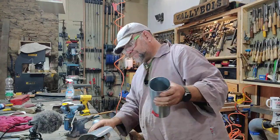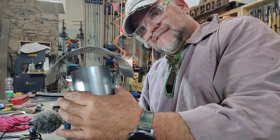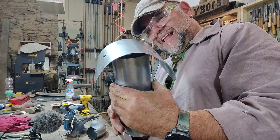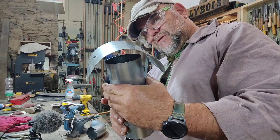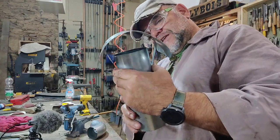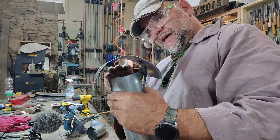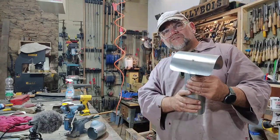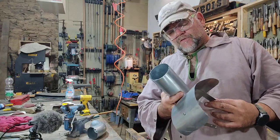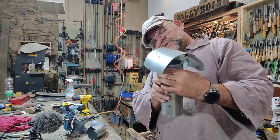So here's my pipe. That cap needs to be attached on there, like that. Now you don't want to be too close, for obvious reasons — you need free flow of gas. The area on top needs to be enough so that whatever comes up that tube can escape. That's plenty enough. It's also going to stop the rain getting in, but also allow the wind to blow over the top to help the draw — you know how chimneys work. You blow over the top and it creates suction through the tube and gets the gases out. With a pellet burner there's its own fan inside, so it's not so much of an issue, but there's no reason why you shouldn't help it on its way.